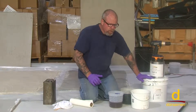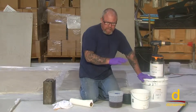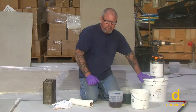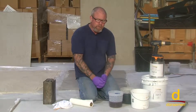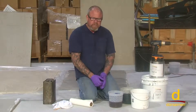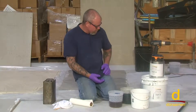What is really important is we need to cancel out the gray substrate — it almost looks white, depending on the color of cement in your area. You definitely want to cancel that out, and we have found that using a pigmented black really is a nice base coat for virtually all of the metallics. With the exception of possibly a pearl or white essence, you may want to prime with a color closer to that. For lighter colors, we'll sometimes mix the pigment powder into a clear as a primer, but virtually all other colors work great with the black.